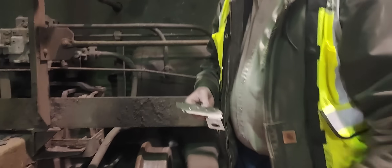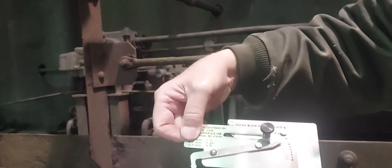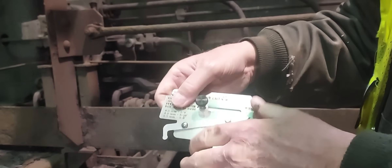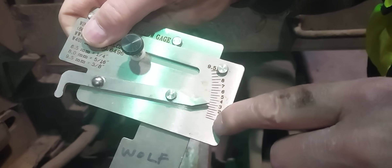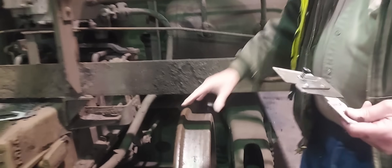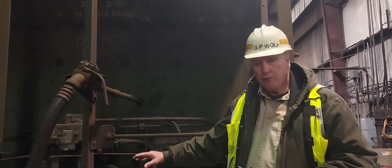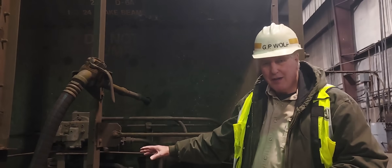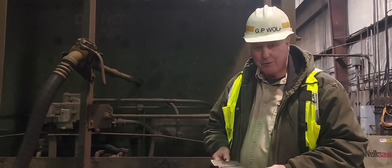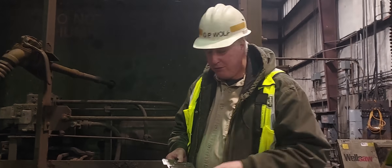The hollow wear gauge has a movable slider that goes back and forth and a lever that goes up and down. You read the millimeters of tread hollow on a graduated scale. Interestingly, every other measurement on a freight car in AAR and federal standards is in 16ths or 32nds of an inch — the hollow wear standard in millimeters is the only metric measurement for a railway freight car.